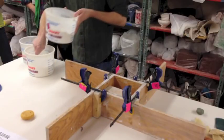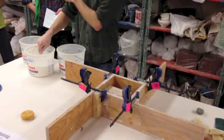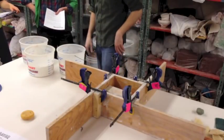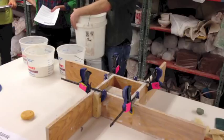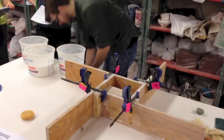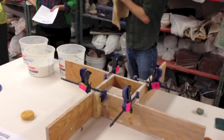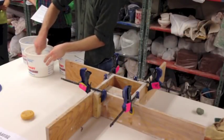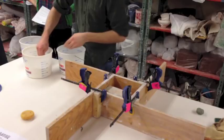Do not use a sieve - it clumps up the sieve and you can't really wash it out. No plaster down the sink ever - this is very important. My sink here: I filled this bucket up with water specifically for this purpose. It doesn't do anything else - it's my hand rinse when I'm making molds. You do not want to dump that water down the sink. Ever. Go to the back studio in the sculpture room after someone has used the sink to find out why. Because it smells back there - that's why nobody works back there.